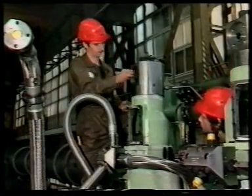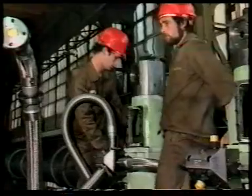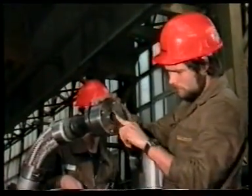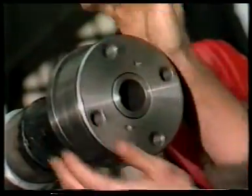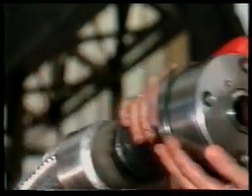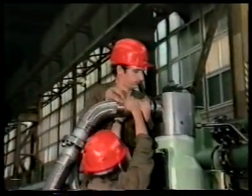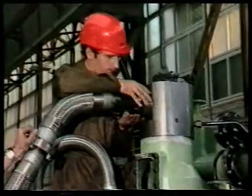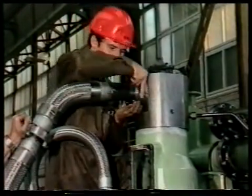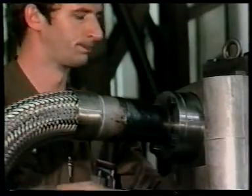All pipes are now reconnected. Ball seats must not be connected if damaged. This flange must be screwed on tight and then slackened by half a turn. Take care to tighten these flanges evenly.